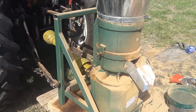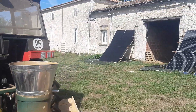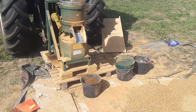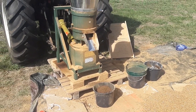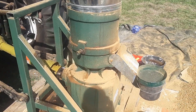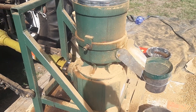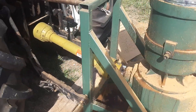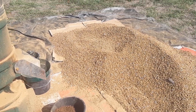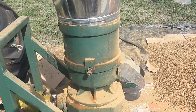I started the journey on pellet making to use as heating in my house a couple of years back. I bought a little electric four or five kilowatt pellet mill from China which does not make wood pellets — it just doesn't. It makes biomass pellets, at best grass if you're lucky. It's for chicken feed or feeding animals. They get stuck pretty easily with anything close to wood, soft wood, and you would never get hardwood in them.